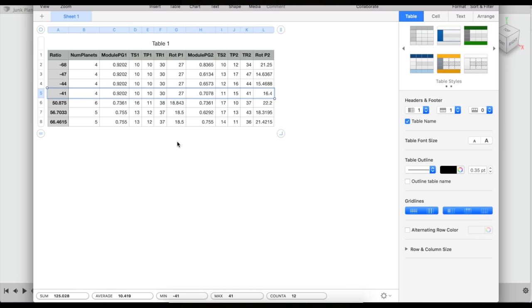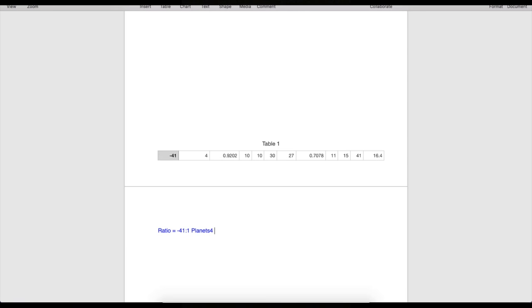So then, once you get your ratio that you want, you just copy, and then I like to paste it into a notepad. The reason I'm typing this up in a notepad is that Fusion 360 doesn't let you enter multi-line text in a sketch, which means you need to keep clicking Add Text. Unless you already have multi-line text, then it'll let you copy-paste it in, and it's much easier. And these numbers mean a lot more when you get them in the program. It's nice to have that sketch saved in Fusion 360 with all of the information that you use to design the gears.